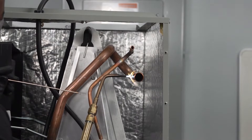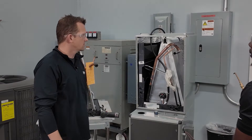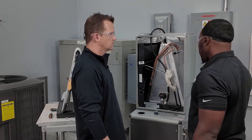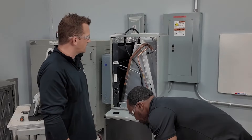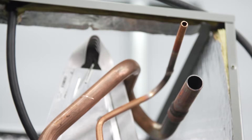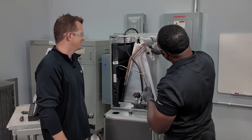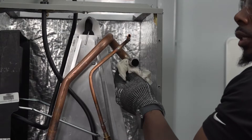Really don't need much solder — and that's that, it's as easy as that. You could put a cold rag on the connections to cool them down faster. With the brazing shield used properly, that's more precautionary than anything else. We certainly want to protect that coil above all else, but proper brazing rod and best practices should protect it anyway. Once cooled, you can check your braze points and make sure you don't have any pinholes in the solder.